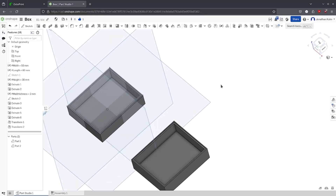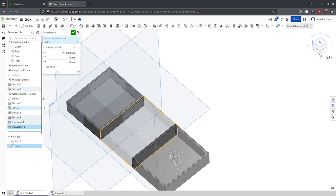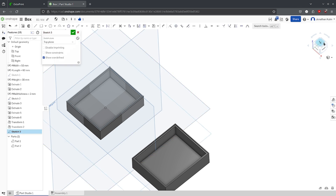Here I have a simple box that I modified from a previous video. We just connect the two box halves with a thin strip of plastic. You can vary the size of the strip, but I would use a value of about the height of one box half times pi as the length of the hinge — I already did that with this transform feature here. This is so the hinge can form a nice half circle when closed. I would make it as wide as the box.